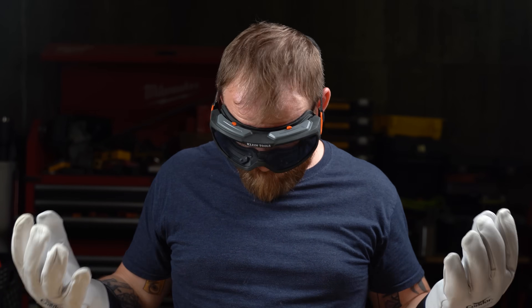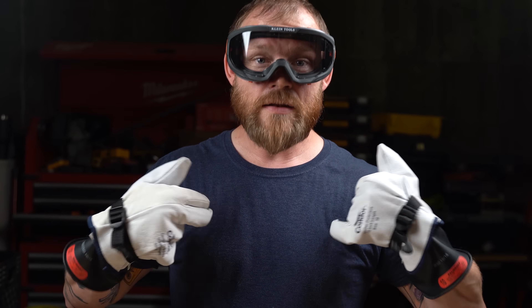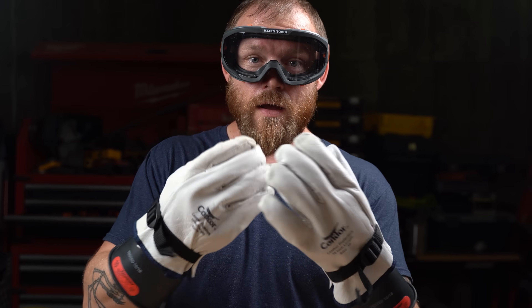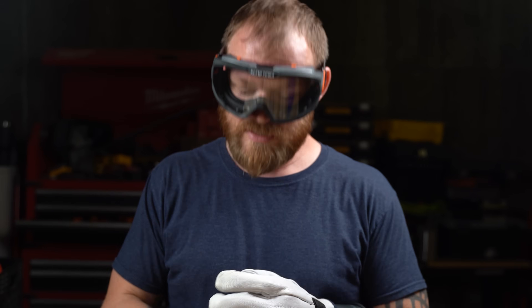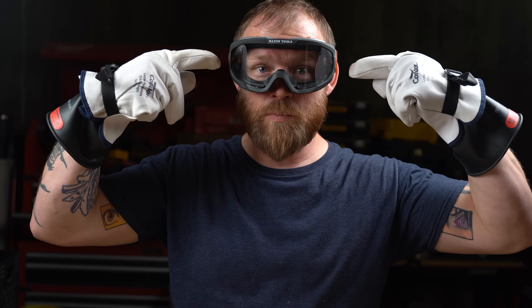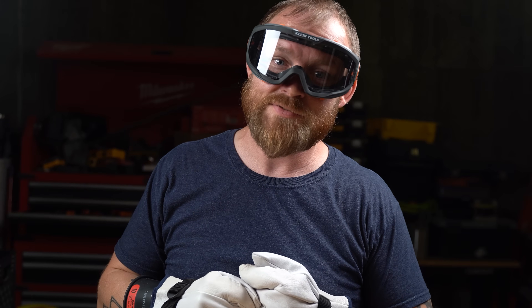120 volts, with the amount of current flowing through this chicken — if it was on either side of your heart where that circuit exists — that's enough current to stop your heart, cause arrhythmia, cause a beating of your heart that's different than your natural rhythm. It can kill you, absolutely. So don't ever let anybody tell you that 120 volts can't kill you or cause serious harm. It's all based on how much resistance you are offering to that current flow. Thank you for watching — be safe, make sure you have PPE, and don't work on live circuits unless you're a trained electrician.